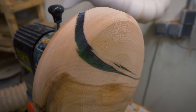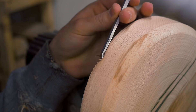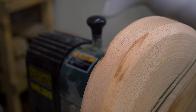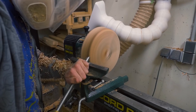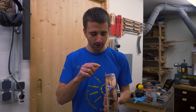Bullshit just happens — the bowl with the most visible resin happens to have a nail right in it, which also damaged my tool a little. Let's try pulling that out and see if we can save the bowl. The chisel now also needs a resharpen — it snapped off. After managing to get more of the metal out, some is still in there, so I'll just reduce the diameter less. There was also another crack showing up that I filled with more resin. Then I got sick for a week, and now I can go on.